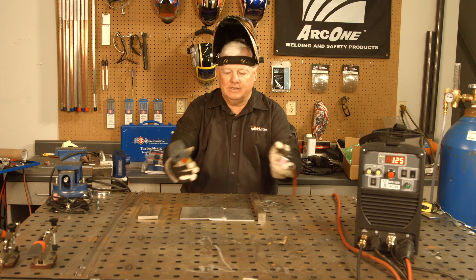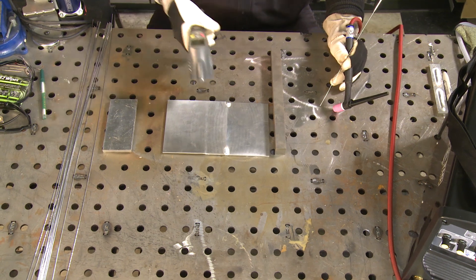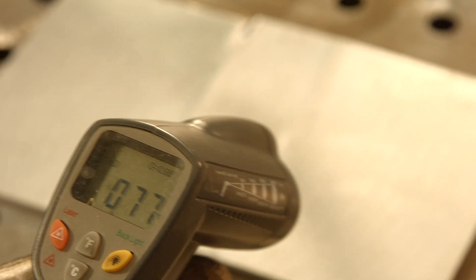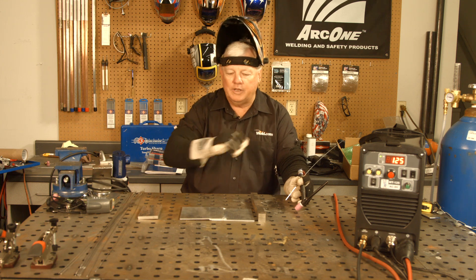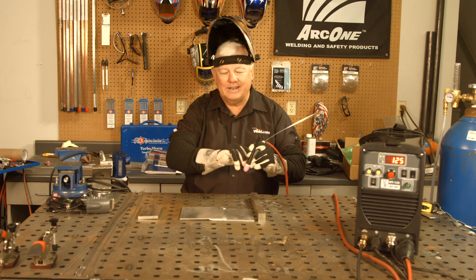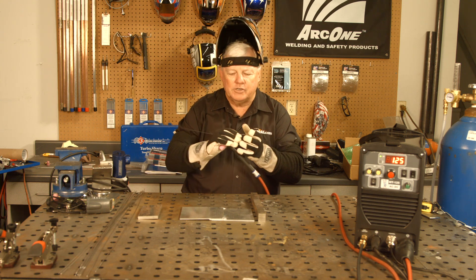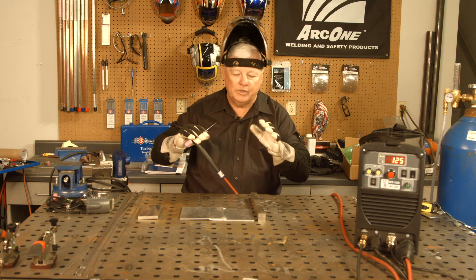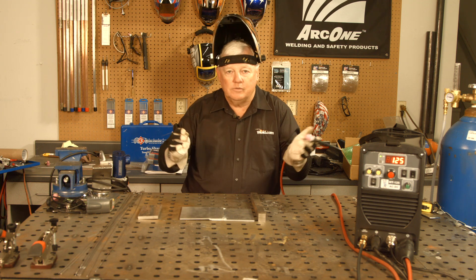I've got my plate in place — this is just 6061 aluminum using 4043 filler material. I've got my infrared here — it's bouncing from 77 to 78 degrees Fahrenheit. I'm checking the table, which is pretty massive. It's 78 degrees, so I'm starting from a cold start. These tacks were put in a few hours prior, so I've got a cold plate. I'm just plugged into 110 household current. In the beginning, just remember that your material needs to heat up a little bit — wait until you can see a liquid puddle. If you can't see that puddle, there's no reason to try to continue adding filler.